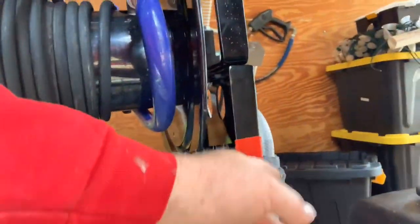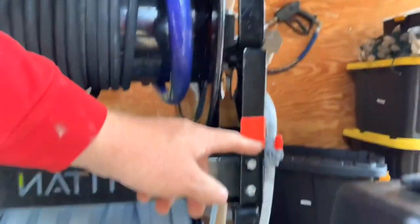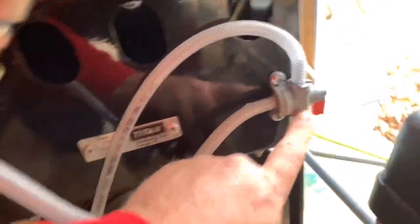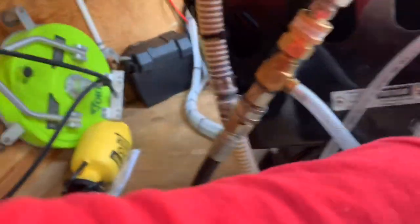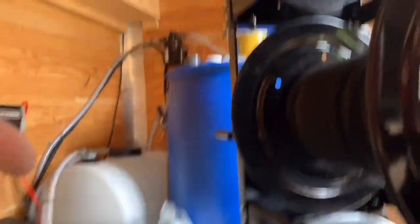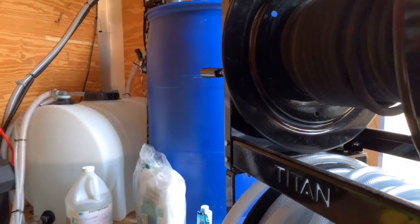Right here is actually where I have it plumbed. When I'm on red tape — tape to tape — that means I'm on soap. When I'm down, that means I'm on water. Right here you can see my three-way ball valve, and this one comes up to my downstream injector. The top one goes back into my water tank right here. My other hose — it's a little bit thicker because I bought it at a different place — goes into my blue soap tank.